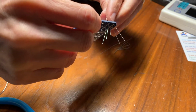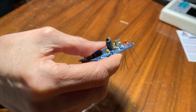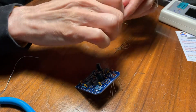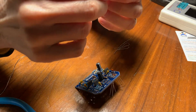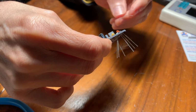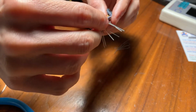You know, in this version you have choices, right? They just show the part as like 1N914, and there's another one, what is it, 1N4148. And that one is pretty much the same part as the 914, as far as I understand. I don't know which of these I have, they're one or the other, so I'm just going to use these.